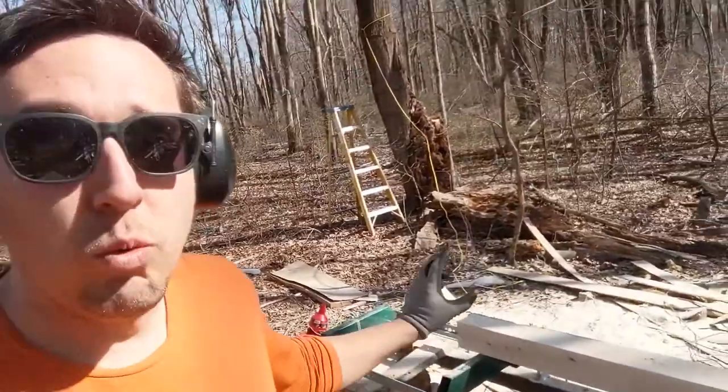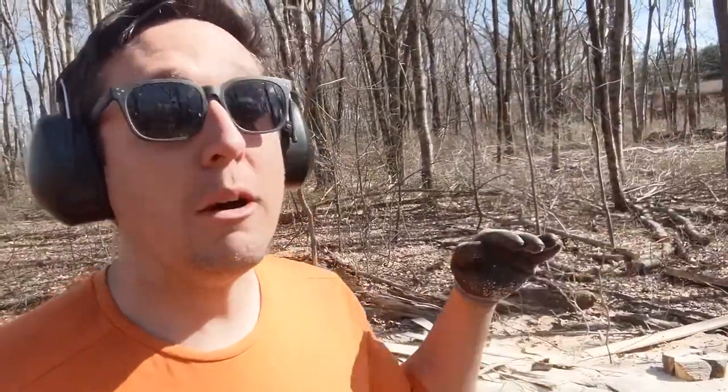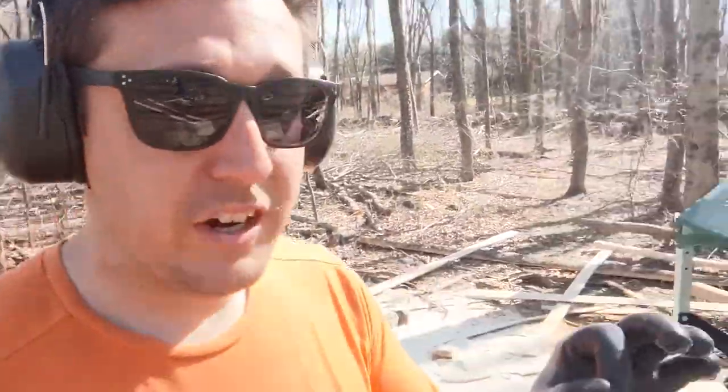When I did my last measurement, one side was thicker than the other, which meant that I was cutting at an angle. So then what I did was I flipped the cant over until I figured out which way was horns up, meaning that one end was sticking up higher than the other. And I had just cut a flat side on one of them. So then I flipped it over onto the flat side that I just cut, so that the log is touching all of the bunks and it's nice and level. And I cut a very small sliver off.